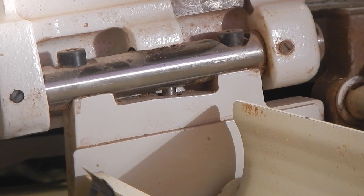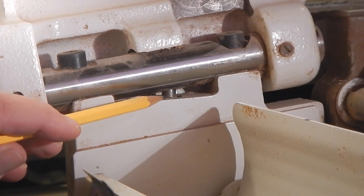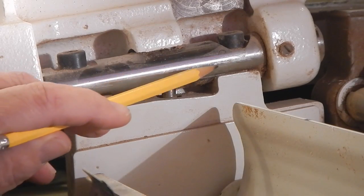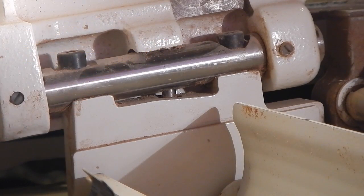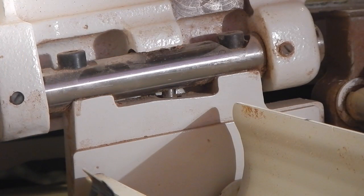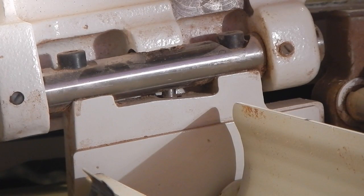The infeed and outfeed tables have similar mechanisms that kept me stumped for years. It basically involves this rod here. What's not obvious is that this rod goes all the way through the hinge piece and actually comes to rest against this bit of the casting. This is not regularly shaped, so it has the effect of a cam. When the table is rotated up, it depresses the lever — the rod will be raised and lowered when the table is raised and lowered.